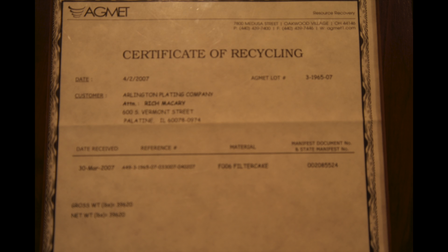Here at Arlington Plating, all of our waste — in fact more than 99% of the waste that we generate with our plating process — is eventually recycled. So we're going to take a walk into the shop, and I'm going to show you how we use the water for rinsing, and how we recover metal hydroxides from that water, how we compress it into a sludge, and how we eventually ship it to a recycler who sells it into the smelting industry. It's an interesting site at Arlington Plating — I'm sure you'll enjoy this YouTube video.